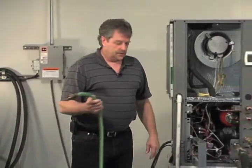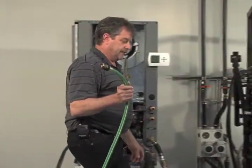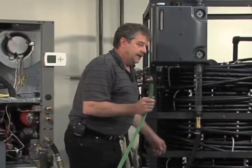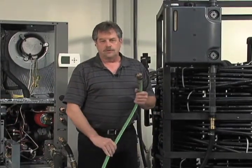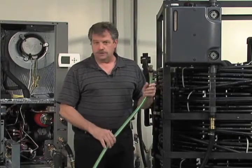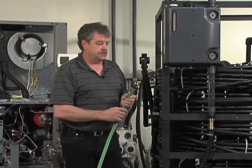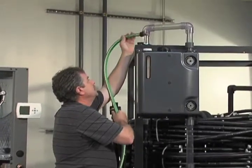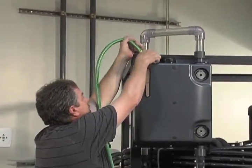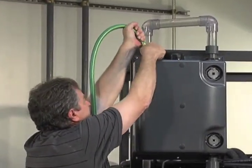You have many options, of course, garden hose, things of that nature, but shoot, if you've got a solution of brine material in your flush cart, you might as well use that as the additive into your tank. So we're going to go ahead and add the fluid into here, keeping an eye on our sight glass, to see how we're doing.